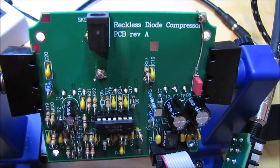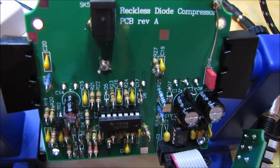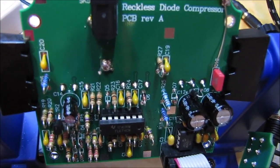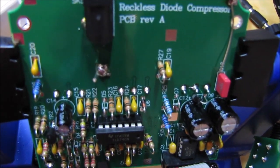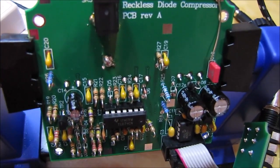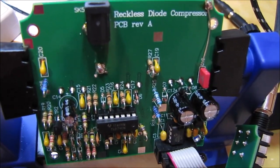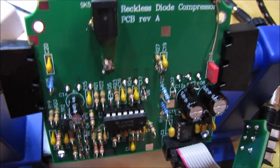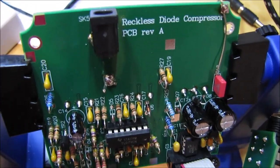Here's the other side of the board — it's all through-hole. There's a single TL074 quad op-amp, a JFET J112 on the input, a set of diode bridge, and a negative voltage supply generated using a TC1044S switched capacitor inverter to generate a minus eight volt supply from a nine volt supply.